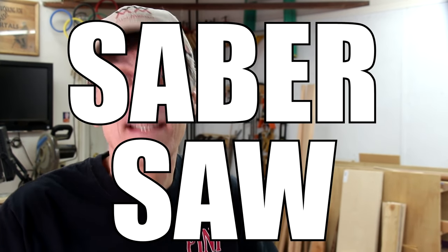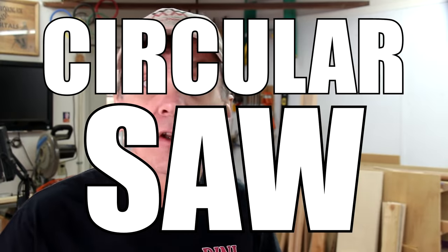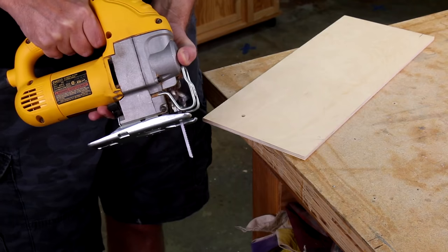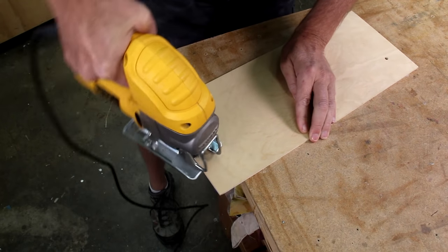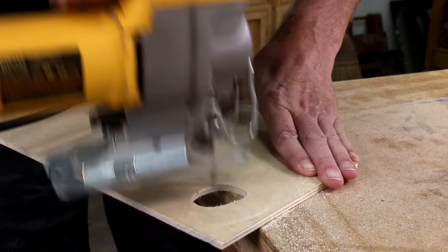Let me start by trying to clear up some confusion in its name. In the past, a jigsaw was often called a sabersaw. Today, a reciprocating saw is sometimes called a sabersaw, but most likely it's called a sawzall, which is just a brand name — kind of like how people call circular saws skill saws. And what we call a scroll saw today used to be referred to as a jigsaw. A jigsaw uses a small blade and it cuts with an up and down motion. The thin size of the blades makes it easy to cut pretty tight radiuses, and it's handy for cutting holes, something a bandsaw can't do.